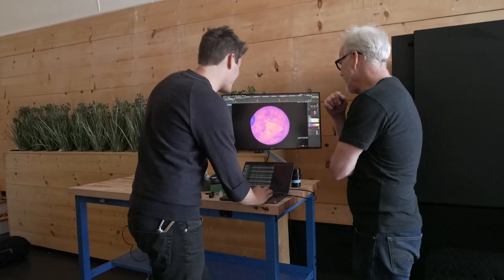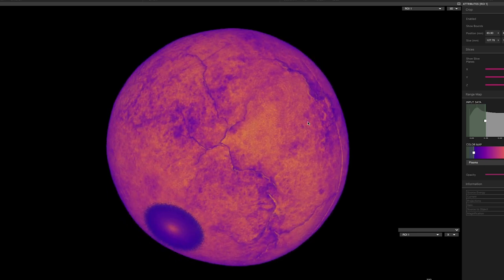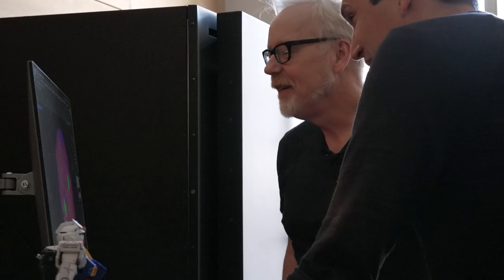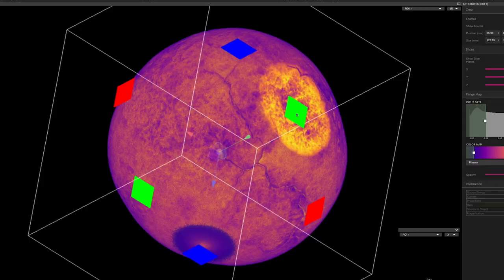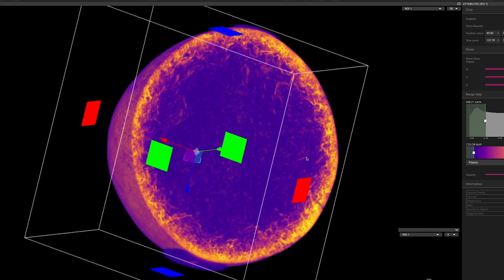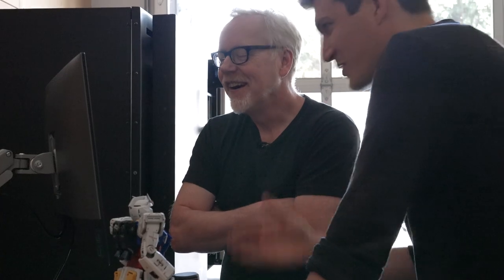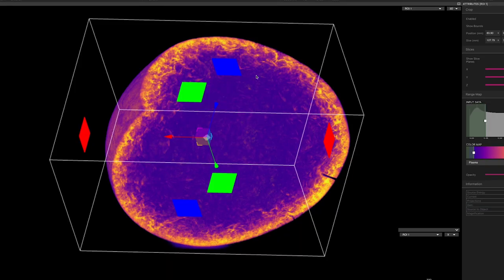You also scanned the aluminum ball that I hammered. It looks like one of Jupiter's moons — it's absolutely wild. We got some insight into what's actually inside. Let's go ahead and chop into it and take a slice. Around the outside edge, that's the highest density because it's the lightest color. What we can verify is what you hypothesized — the outside was getting denser as you were compressing and compressing it, but you're asking the outside to compress the inside, which is a tall order. We can validate that it's actually much less dense inside. We can really see that hard outer shell.